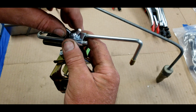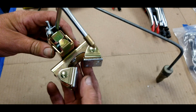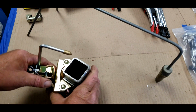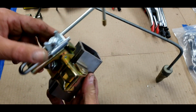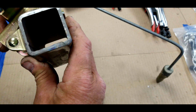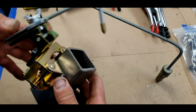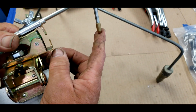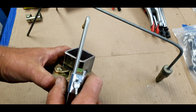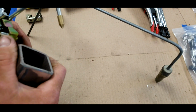So you could nail your part. So you could do that on maybe a square tube. See, with these, you can use these vertically. So if I wanted to stick that down on a square tube like that, I've got two nice neodymium magnet pads stuck down there, and then I've got a welding finger that can come in and hold a part down for me, and it's adjustable, so you can swivel left or swivel right, whatever you want. So that's pretty cool. It's not just for horizontal work.